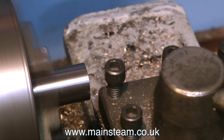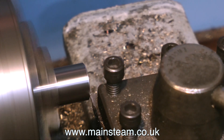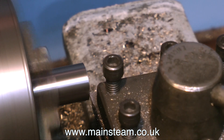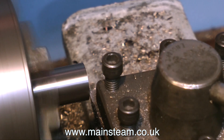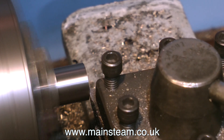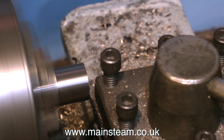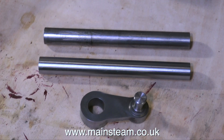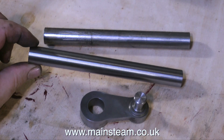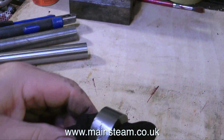I did this on quite a few engines and the axle boxes lasted a long time — I've seen axle boxes wear out in a couple of seasons. I don't do it that way anymore though, because the last engine I built uses ball racers just about everywhere, so I don't need to. After machining the new crankshaft to the required seven inches in length and center drilling it at each end, here's the finished product: one seven-inch long piece of silver steel, ready to fit to the crank web.